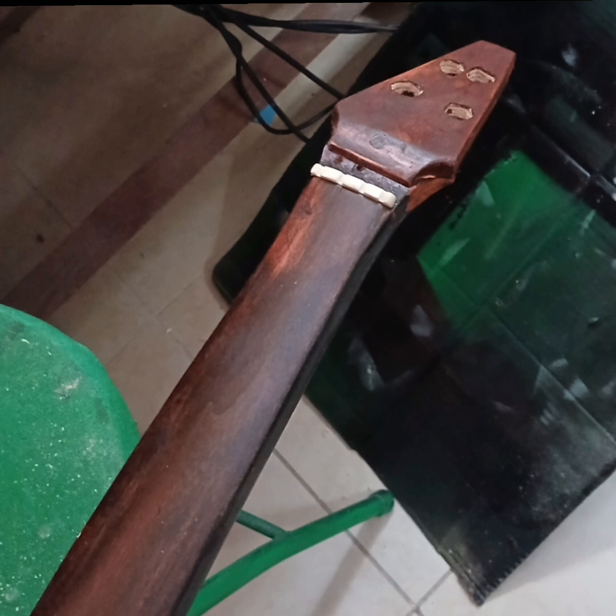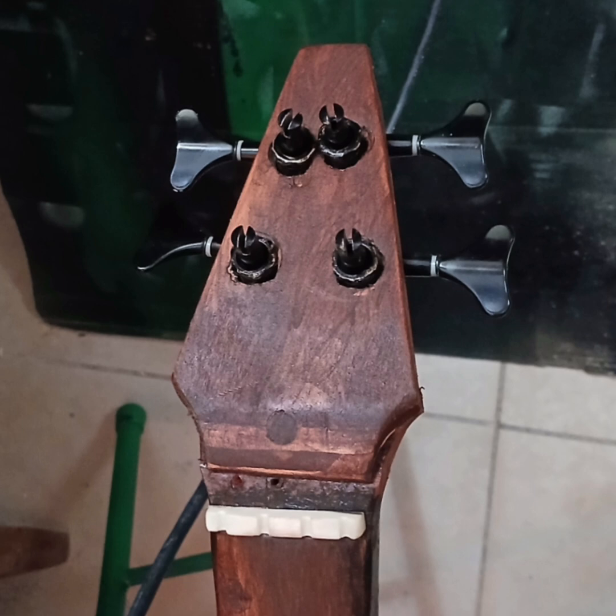And if you notice, the positioning of the holes was kind of wonky. Did the best I could with the tools that I've got. Tried to center the holes with a small pilot bit and then use a bigger bit, and then the biggest bit that I had before going to something way too big wasn't exactly the right size, so I ended up having to sand that, file that out so that the tuners would fit in, and the positioning was a little bit off, but did the best I could. When it's all together, it's not quite noticeable unless you're looking at it real close, but I'd prefer to get those positioned perfectly, which is hard to do without a drill press.